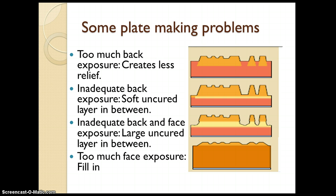These are the general ideas about the photopolymer plate making process — specifically the sheet photopolymer plate making process. Similarly, the same process is carried out for liquid photopolymer plate making; the only difference is that the photopolymer layer is in liquid form, which has to be placed onto the base polyester sheet before exposure. Thank you for listening.